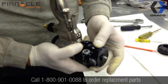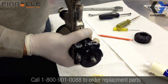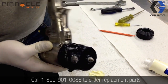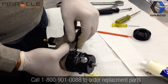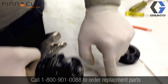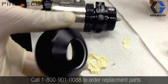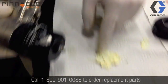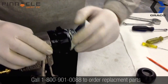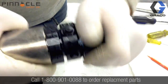When installing, make sure that the check valves and filters are facing downwards on the handle, and this fitting here just needs to be hand tight. Now we're going to insert our retaining ring for the side block seals. In the retaining ring there is one nylon o-ring that we need to have in place. We'll apply some grease to the threads to make sure this is going to be easy to disassemble in the future. This fitting is also just installed hand tight.